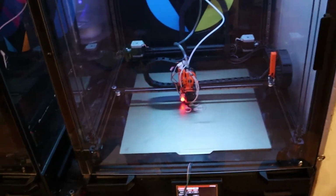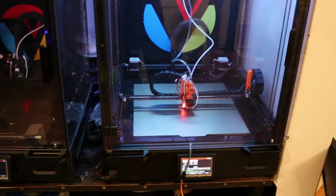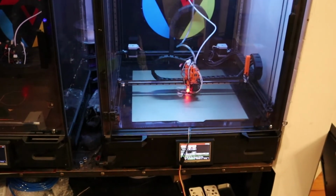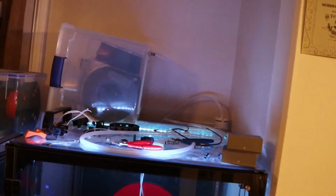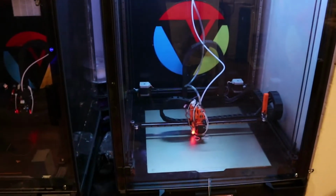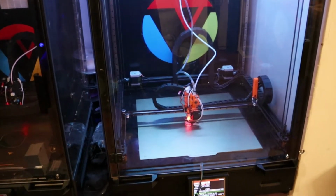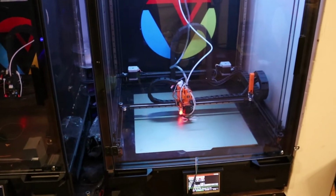the Berd air is pretty much working really good, and removing the flux ring should keep it a lot cooler. I haven't had any issues with the heat. The other thing is, if you put a 6 to 12 inch piece of tube on the intake for the back, it makes the pump way, way quieter. That's honestly why my pump is so quiet compared to all the other videos that you watch. Without that on, the pump is really noisy. There's no reason to print any of those mufflers or any of that fancy stuff. Just put an intake tube on it and you're done.